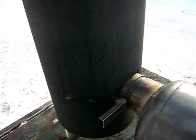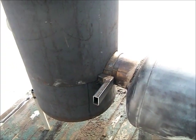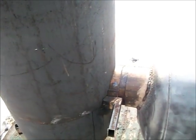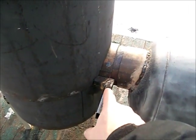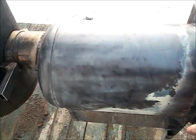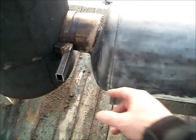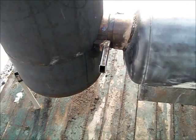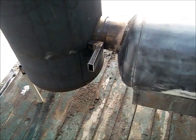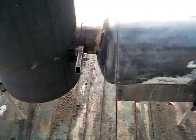A lot of people talked about the secondary air intake. Until now I could not do anything about it, I just had to leave it there. But once everything is put together and welded in place, what I'm going to do is take the secondary air, put it right through the stove and bring it out here, so that it passes through the stove and the air will heat up a lot. I put it there for now because I could not bring it through the stove without welding the whole thing together.